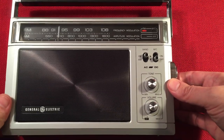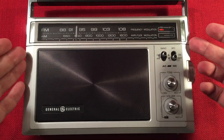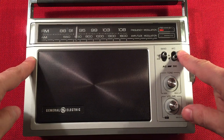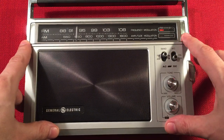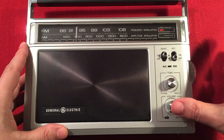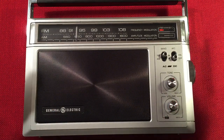Most analog radios like this are okay to good. For this particular radio, okay to good is about 48 to 50 stations, by the way, for average analog radios. This one's above average on FM. Couldn't believe it. This scored good to very good, which is found 70 stations. I was completely flabbergasted by how many stations I found. With the AFC off, I was finding things left and right, and it was coming in fantastic. They were all coming in great.